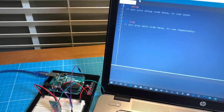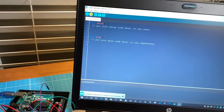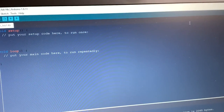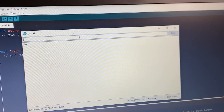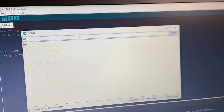We got a green light — it's a happy camper. Now let's see if we were successful. We pull up the regular serial monitor in the Arduino software — no need for third-party tools like PuTTY. We're defaulting to COM7, so I'm just going to send an AT command, and it comes back as OK. That is 100% success. There are some other commands we can enter too, though it's a very limited command set with the HC06.